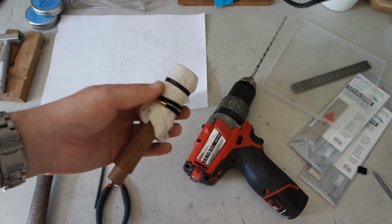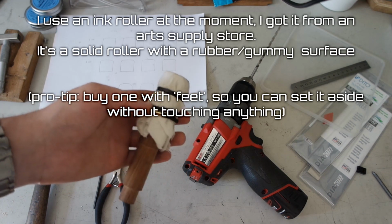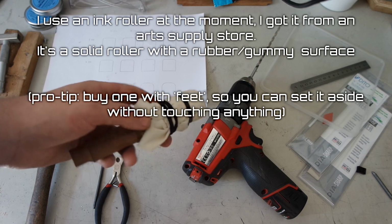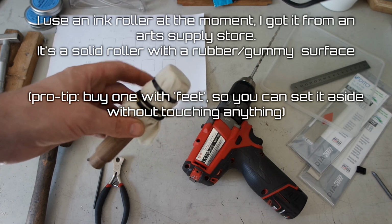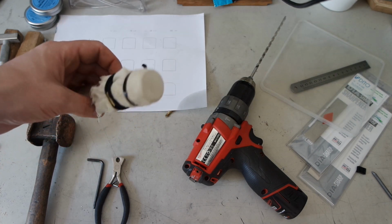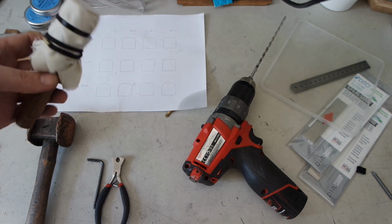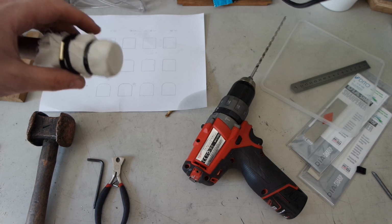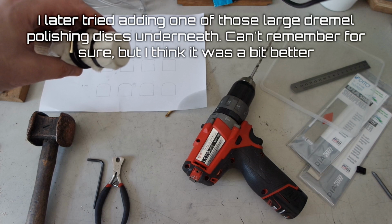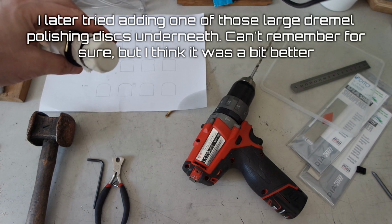I've made this sort of stamp to apply the bluing. I've seen people use rollers to make a film of bluing on a surface plate, and I've seen people recommending a few layers of cotton to do it. So I've made a cotton one. They say the cotton layers of bluing are a bit less thick, so you can get a better contact with the surface you're scraping.